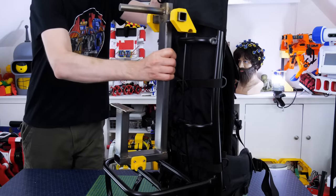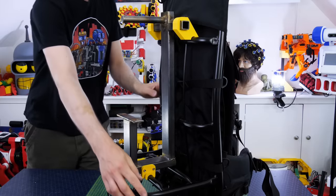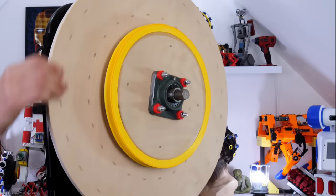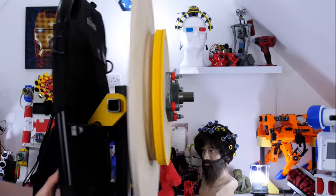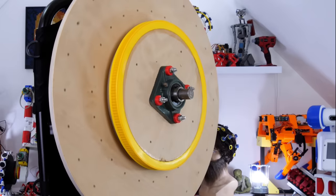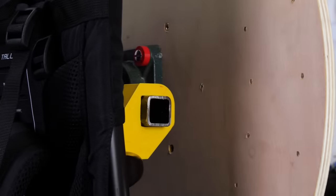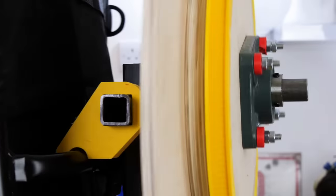So that leaves us with a steel frame with some 3D printed brackets that attaches neatly onto a frame rucksack, which I'm going to wear on my back. So we've also cut some wheels which are going to make the main reaction wheel, and that's mounted on bearings on some bright steel bar welded to the frame, and I've got a 3D printed HTD profile pulley on there so that we can move that reaction wheel and hopefully it'll help me balance.